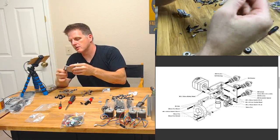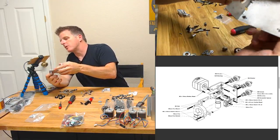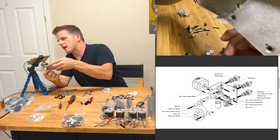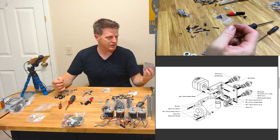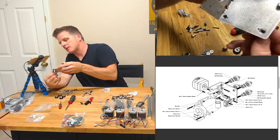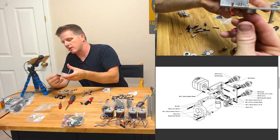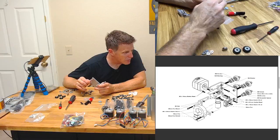Who am I to judge, like, PrintrBelt doesn't know what it's doing. Okay, so check it out. I said it left something to be desired because I'm like, well, that's strange. That hole's off-center. But here's why it's off-center. Because what's on the other side of this? The wheels. And if we want to adjust how tightly they're grabbing around the extrusion, now we have the ability to do that by rotating the eccentric spacer. Duh. Brilliant.